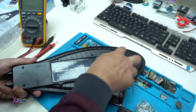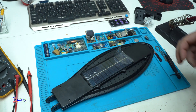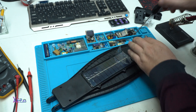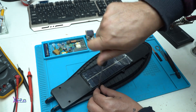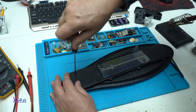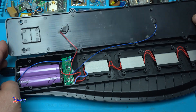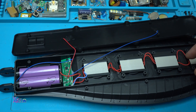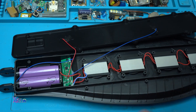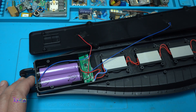I assume that with these screws everything is placed in this section. Let's open now. We have two, four, six, eight screws. Now let's find out what's inside. Pretty simple design. We have four LED chips connected in parallel. We have the PIR sensor together with the charging circuit. And believe it or not, in this product they put two 18650 batteries.